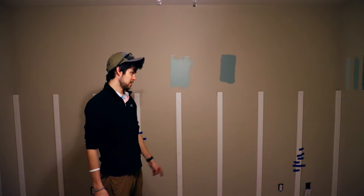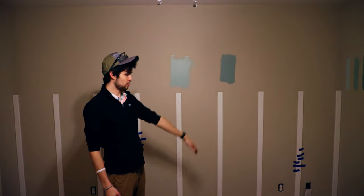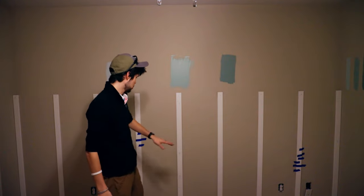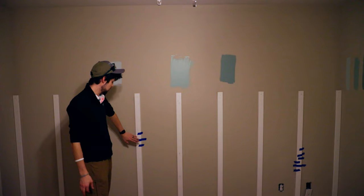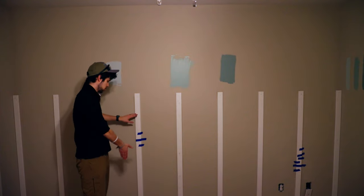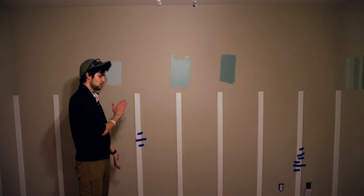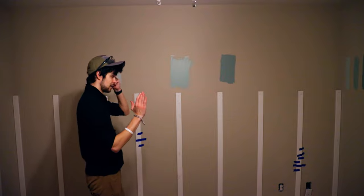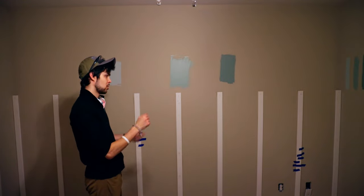The hard part is done. It took some time to get all the vertical battens in. My wall has some curvature and bowing to it, so I had to use glue and really try to take it down a bit — it took a while standing there holding each one. I also had another one on the other side doing the same. I was just trying to get each board as flush as possible to the wall before using the caulk.